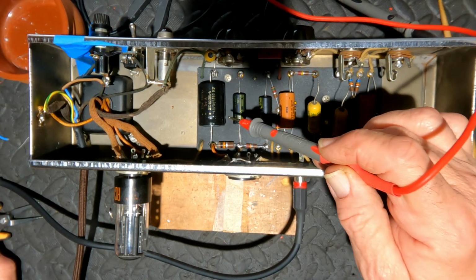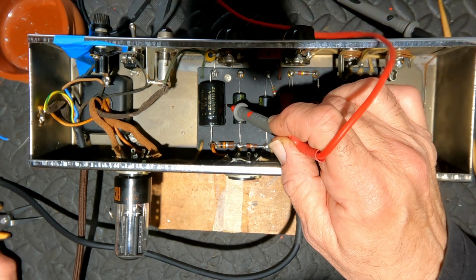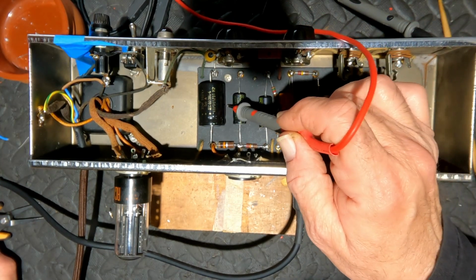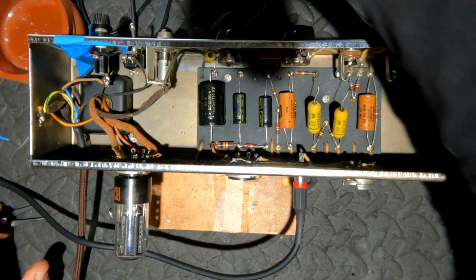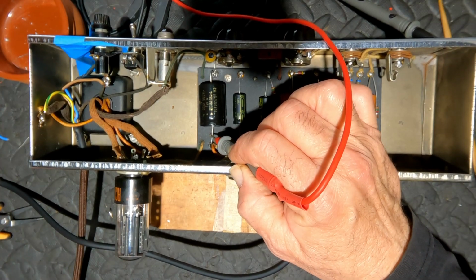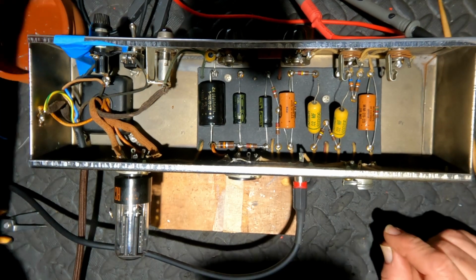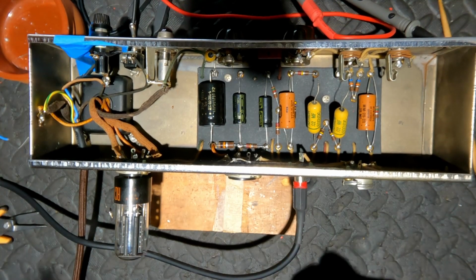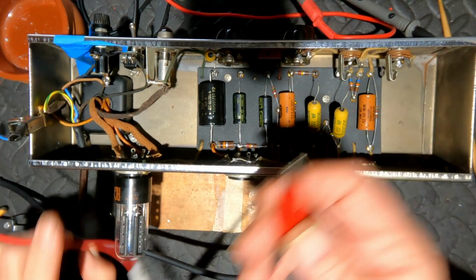But capacitors and heat generated by resistors are generally not good bedfellows. So I might opt for a larger resistor just so it's going to, you know, discharge faster than that. And what are we up to now? Still got 360 volts on it. It's just not good. So you have to always discharge it and not trust an amp to discharge itself.